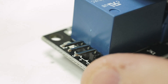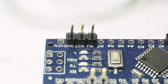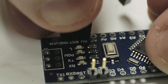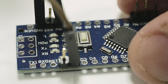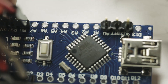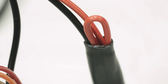Take a three-wire female-to-female dupont connector ribbon cable and connect all three wires to the signal, the positive, and the negative terminal on the relay. Now attach everything to the Arduino: connect the positive wire to the five volt pin, the negative wire to the ground pin, and the data line labeled S on the relay to your D2 pin. Next, plug the sensor's ground into the ground pin on the other side of the Arduino next to D2. Then connect the three-pin dupont connector to the three-pin header, making sure you line up the voltage, voltage reference, and analog zero pins correctly. Remember we're running the 3.3 volt pin back into the reference pin — you can see the loop in the dupont connector.